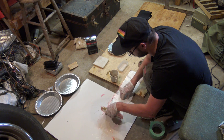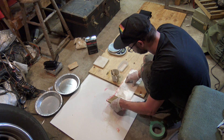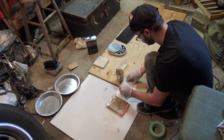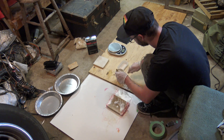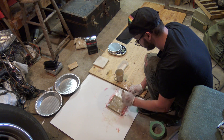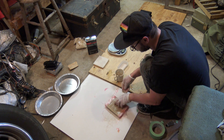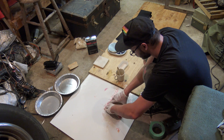For both plates I used 4 ounces of resin and two 4-foot strips of fabric each. The total weight of the fiberglass one was 0.75 pounds — three-quarters of a pound. The nylon one was right under a pound because that nylon is considerably heavier than the fiberglass. Also, I'm wearing latex gloves, and the garage door is open. Remember that fumes from epoxy or any other thermoset resins can be very toxic. Either wear a respirator or do it in a very open space. I wasn't too concerned since this was a small amount — only 4 ounces — but with a larger amount I would have had my respirator on.